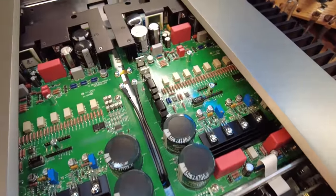Here we see eight output transistors per side. We measured voltages, and they're conventional 70 volts at the rails — so the amplification section is conventional voltage; there's nothing really magical about it at that stage. We also see soft-start relays and the capacitor banks per side. Their literature states 12,000 microfarads per side — there are 12 capacitors, each 1,000 microfarads, which is where they get to 12,000. A couple of fuses in there and a module to control the trigger. The chassis itself is really where they spared no expense.